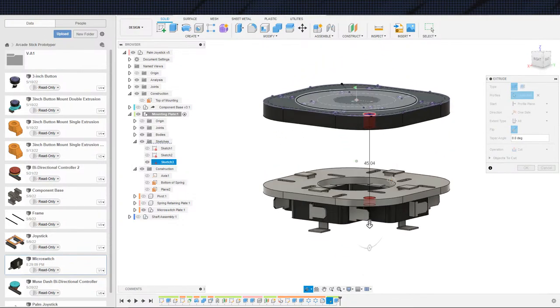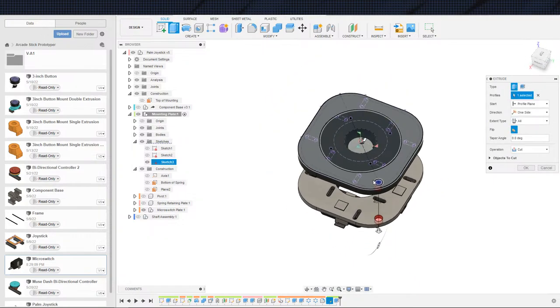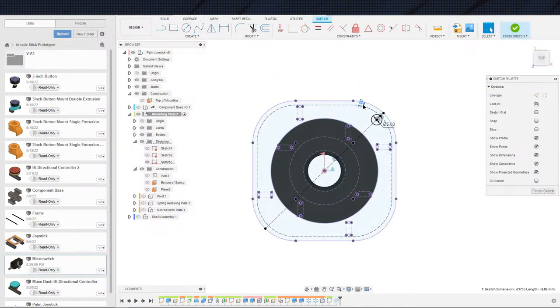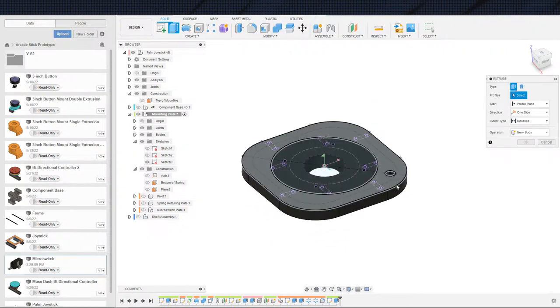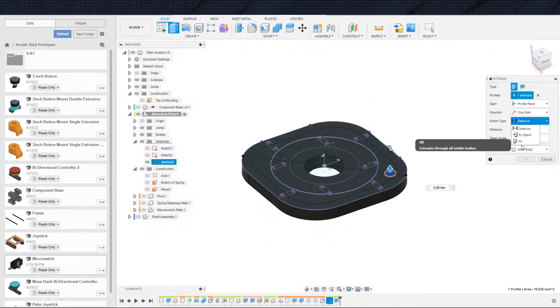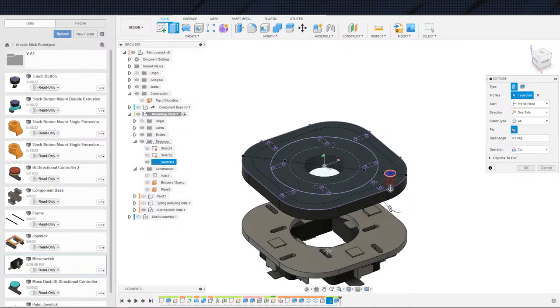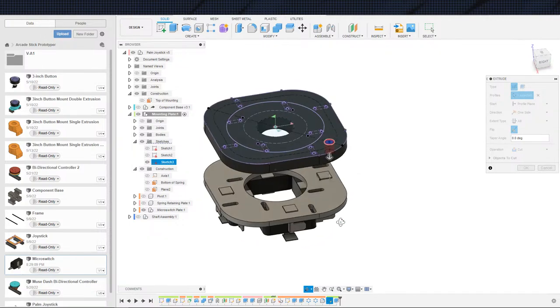We've got to remember that. So it's actually better to bring this hole further in to dodge that tongue. So that's what I'm going to do. So we'll just hop back up into the sketch. This is an easy thing for us to fix here. So I'm just going to go minus 5, and then we will do the same thing we're about to do, and we should hopefully miss this time. Distance all, and this is trusting that my model is accurate, which it probably is.